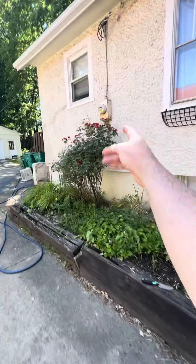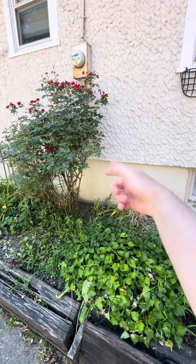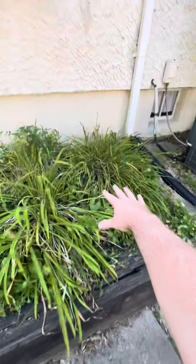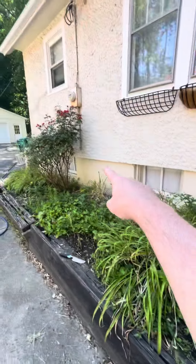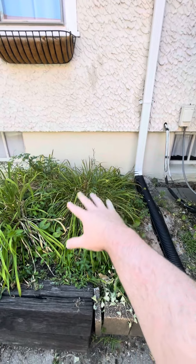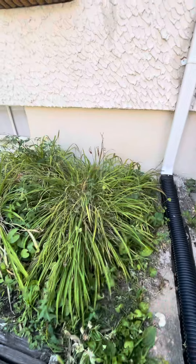Panels coming into the basement here, obviously. You got two options: either you run the wiring out and put it underneath that little lip right there, because we're going to put the unit here. Or the basement's unfinished — you could run the wiring down and then pull it out right here. She's going to move these plants so we'll have a spot to level the ground and put a pad down.